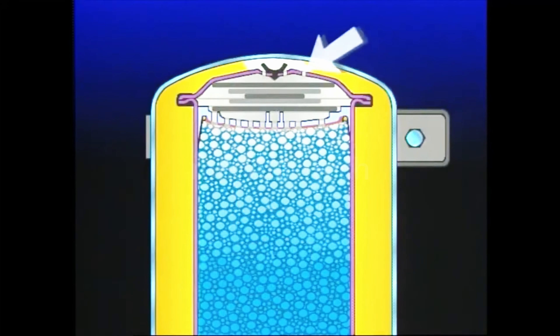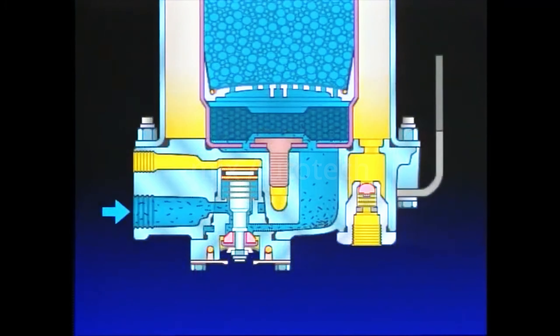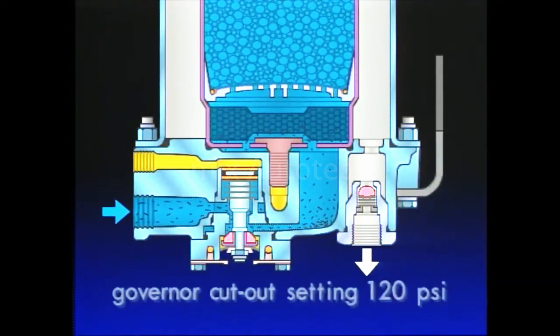While some air will flow through the orifice adjacent to the check valve, the majority of the dry air exits the desiccant cartridge through its integral check valve to fill the purge volume between the desiccant cartridge and outer shell. Dry air in the purge volume flows toward the end cover and passes through the single check valve, out the delivery port, and to the supply reservoir.